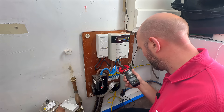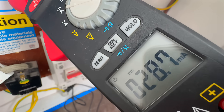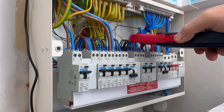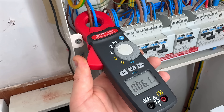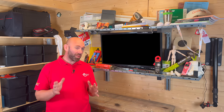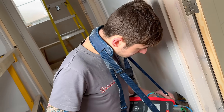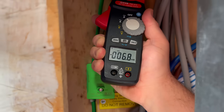Just like on my installation at home — I'm testing on my main tails and getting between 25 and 30 milliamp DC. That is a combination of all the circuits in my installation. So what I can now do is use the TIS-570 on each individual circuit to see where that DC leakage current is coming from. So while the guidance isn't crystal clear, as professionals we mitigate risk — and if we're not testing for DC leakage, is that a risk we're willing to take?